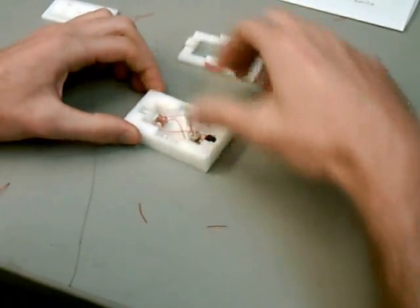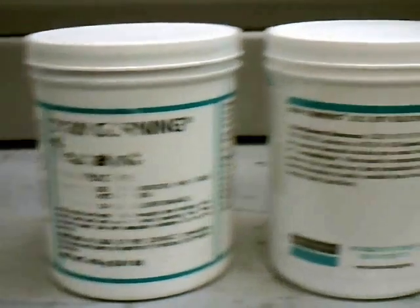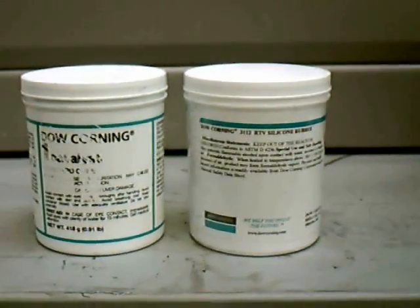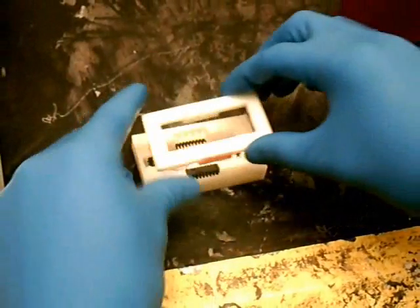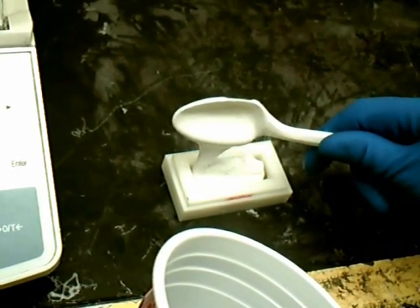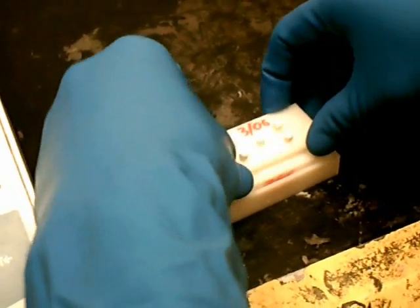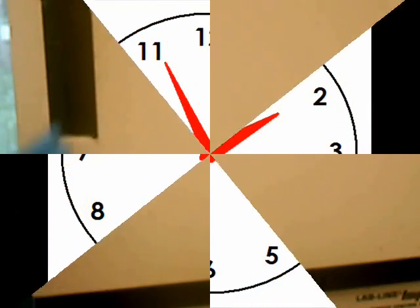Once all the parts are firmly in place, the mold is ready for pouring. The rubber compound we are currently using was chosen specifically for prototyping — it tears somewhat easily, allowing us to recover parts from it. Pre-measured amounts of a rubber base and catalyst are mixed thoroughly before being poured into the mold. The rubber settles in between the components, holding them in place. When the lid is placed on the mold, it allows excess rubber to escape. The mold is placed in a 60 degrees Celsius oven, which activates the catalyst. After several hours, the rubber has hardened.